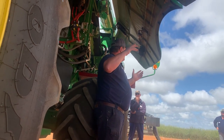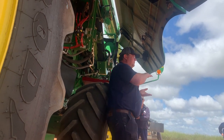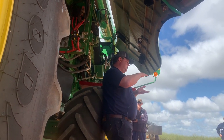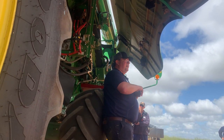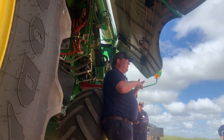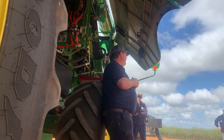drum, and when you get into really tough crops, like bulky crops, the gap between the floor and the drum is not really that much. It's about that much, about 6 inches. So then you can get a 14-inch drum, which gives you an inch more gap between the floor and the drum, so that makes feeding a little bit better.